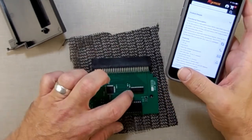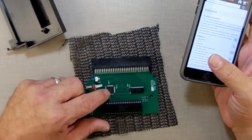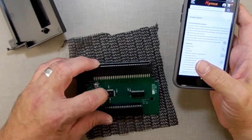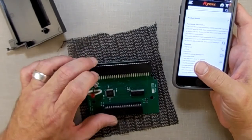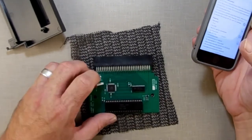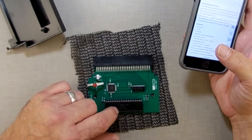So this is your 32K of RAM right there. This is your I.O. that's controlling your input-output in probably just for this only. I'm assuming because just looking at the pins and stuff here, I don't think this has anything to do with the RAM. It may, but I'm pretty sure you can just drop RAM right on the expansion bus of the Colecovision and it'll work just fine. So this right here is handling the I.O.